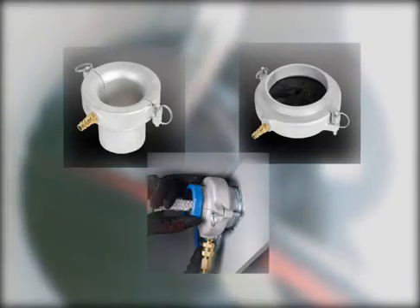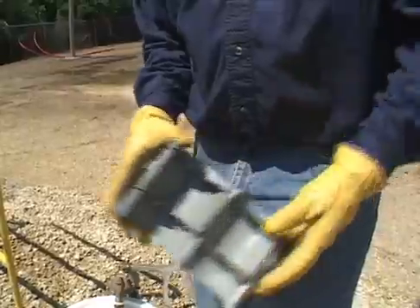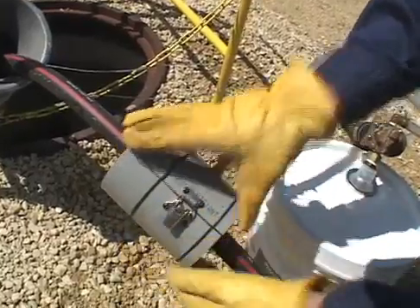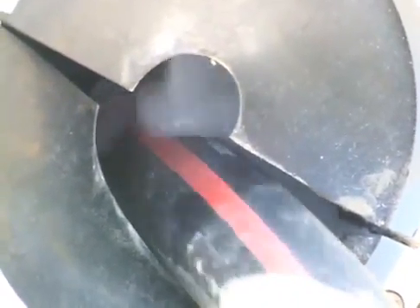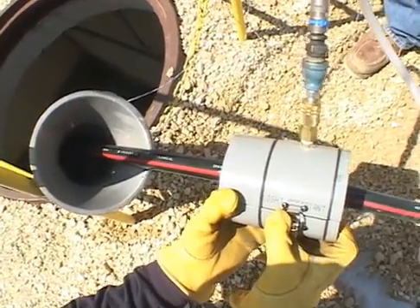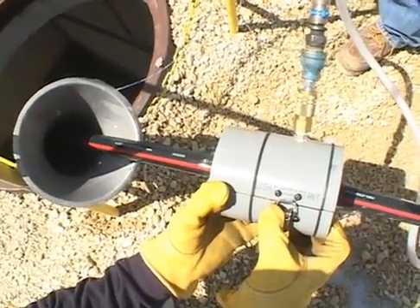There are several different types of lubricant applicators that you can use to apply Polywater lubes to cables. Open this split device by releasing the hasp in the middle of the applicator. Place the device around the cable or wires and refasten. As lubricant is pumped into this applicator, the internal applicator flaps coat the cables as they pass through. Control the pumping rate to completely coat the cables, but not overfill the sleeve. Lubricant applicators can be used in horizontal or vertical applications. Gel lubricants are recommended to prevent lubricant dripping.